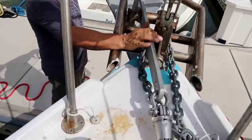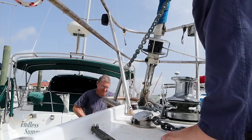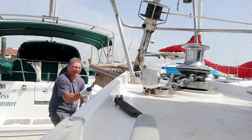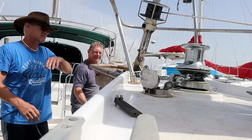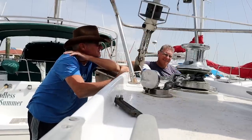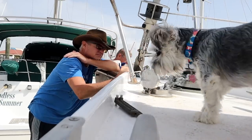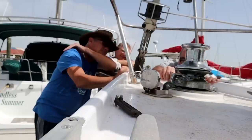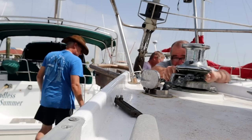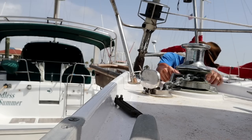Okay. You're gonna set the camera down. You need two hands on the chain because you're gonna help pull the ball. Okay. All right. Let it go. It slips a little still. Maybe the wrong size chain for your windlass. It's so darn close though, Gene. Yeah, I've had that problem. When you look at it, it looks perfect. It just drops about every fifth link. I say it's too small. This is made for bigger chain. Look, you put it up there and you put these two links in there perfectly. Look at the slack on that one right there. Put it in there perfectly, two on each side, and the one that links those two, when under load, the second one isn't reaching.